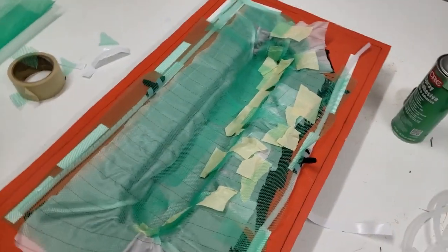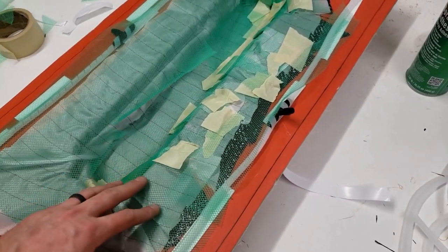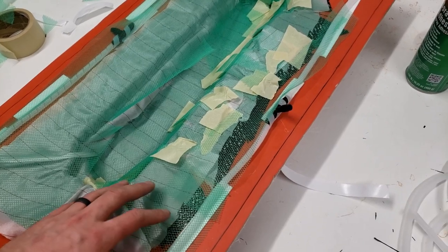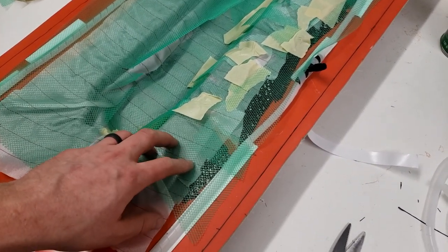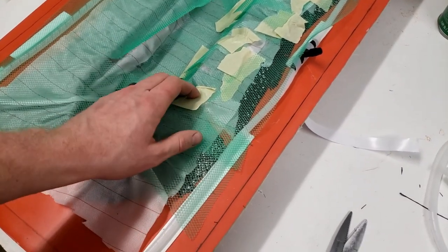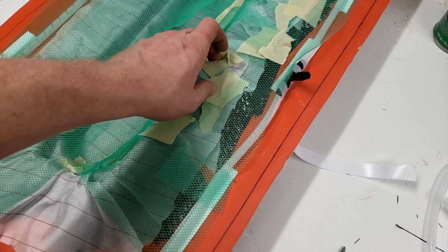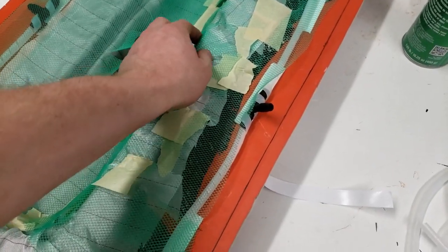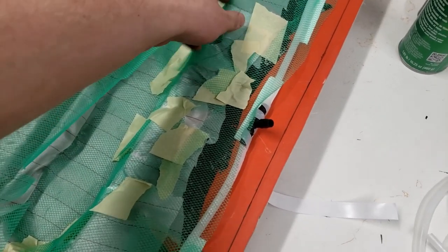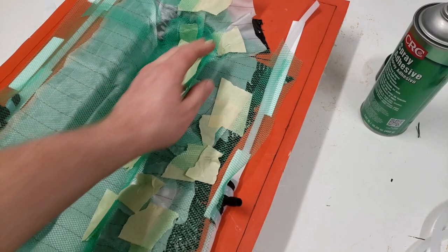Okay, so it looks ugly, but I think it's gonna work. The masking tape here is because this mesh is not flexible. This is the peel plies underneath this white stuff, then the flow mesh is on top. This flow mesh isn't flexible, but you can't let it bridge in these little inlets and grooves. So what I had to do is splice multiple sections in here so that this would have the flexibility to bend down into the part when the vacuum is pulled on it.